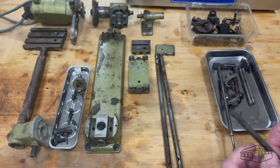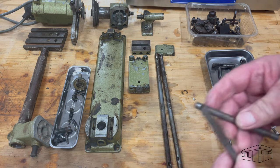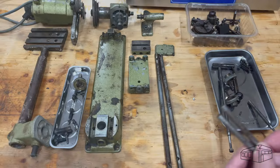After dismantling the lathe, it looks to be in good condition. The lead screws look okay with no real visible wear. The crossfeed rails are dirty but usable. However, the bed rails are corroded beyond recovery. So I'll replace them with 304 stainless steel ground bar.